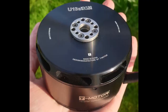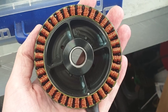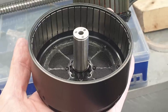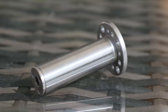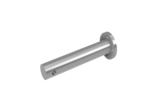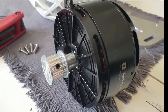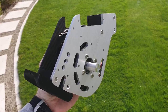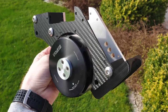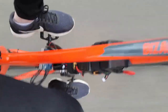That was the final design for the next year and a half, until I decided to upgrade the motor. The diameter of this new motor is 25% larger than the previous one and has 42 magnets instead of 14. The only problem was this motor lacked an output shaft long enough to mount a pulley, as it's designed for mounting propellers. So I had to make my own shaft, bolting to the motor housing, passing through all the bearings, and attaching to a pulley. This was then bolted to a new aluminium motor mount, with the other mount plate cut from three-millimeter carbon fiber to avoid the magnetic eddy current issues again. Upon testing, there was a noticeable vibration from the motor.